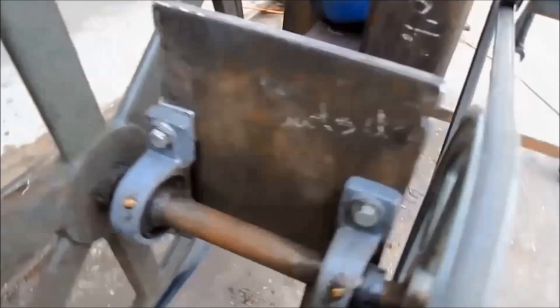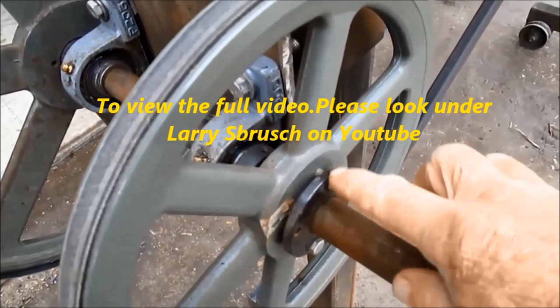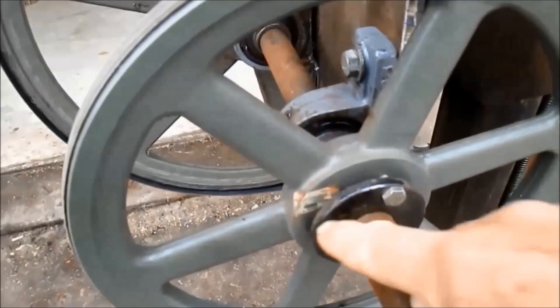Now they make two different types of shafts. One, you could use this little squeeze collar or whatever they call it to tighten it up and keep it in place, or the one that presses on the shaft. I preferably like this type here because I can move it very easily if I need to. Pull the screws out, put them back in these two holes, it pulls this out, put them back in, it tightens it back down in the place you want it to.